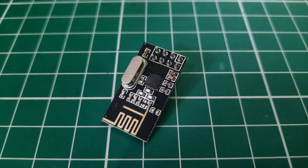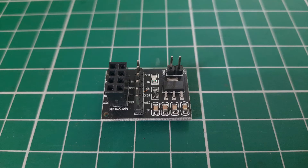The input voltage of the NRF module is 3.3V. We can directly connect it to the 3.3V pin of the Arduino, but the 3.3V pin of the Arduino does not deliver the desired current for the module. Hence, it is better to use the base module, which is just a 3.3V regulator that accepts 5V as input and gives 3.3V as output.